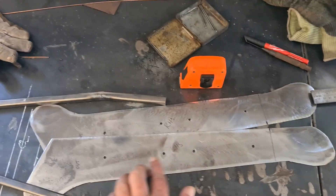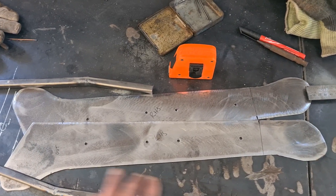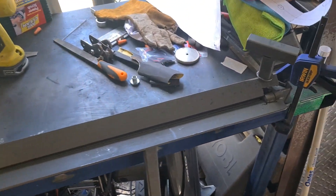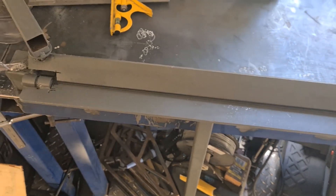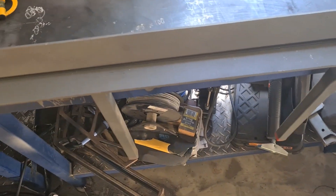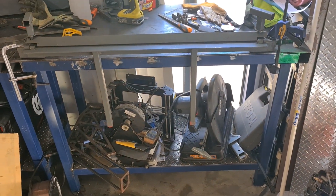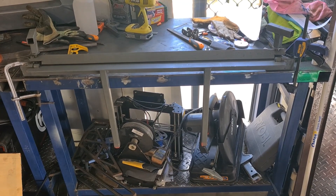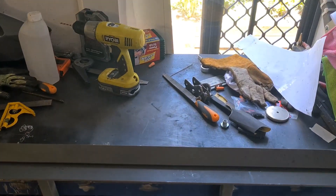I've got my two side pieces cut out — left hand side and right hand side — with some little pilot holes through for the cutouts so I don't have to do that later. I need to put in the kinks and bends to match the pattern, so I'm going to do that in my hand brake. There's nothing magical about it — it's just three pieces of angle iron with a hinge: two pieces back to back and a piece on top to clamp down on the material, with bolts tightening down on either side. I knocked it up in about 45 minutes out of stuff I had laying around.